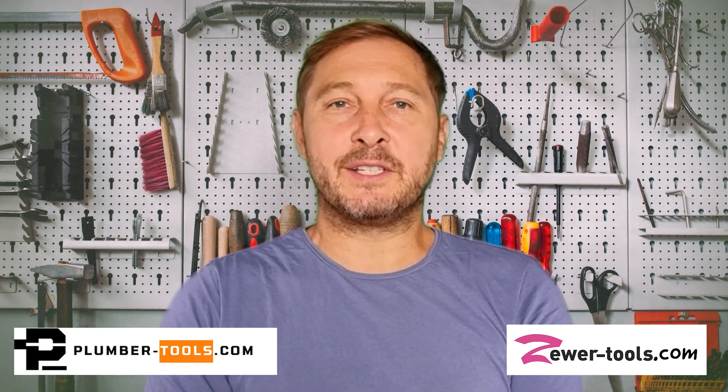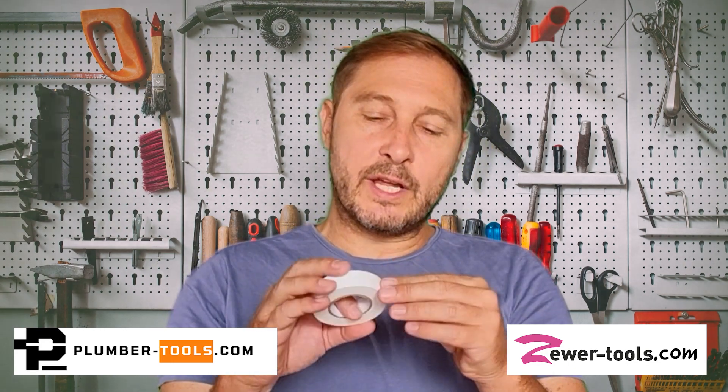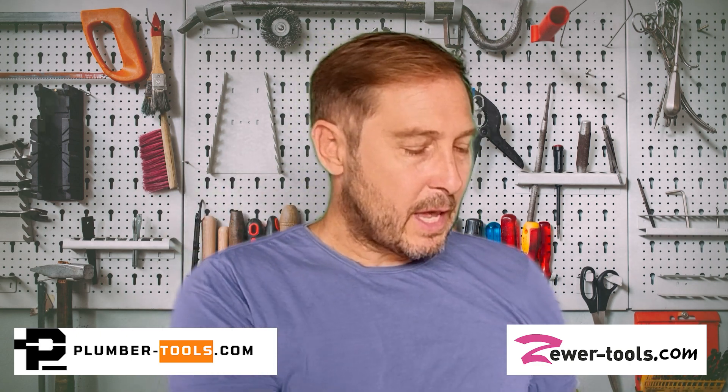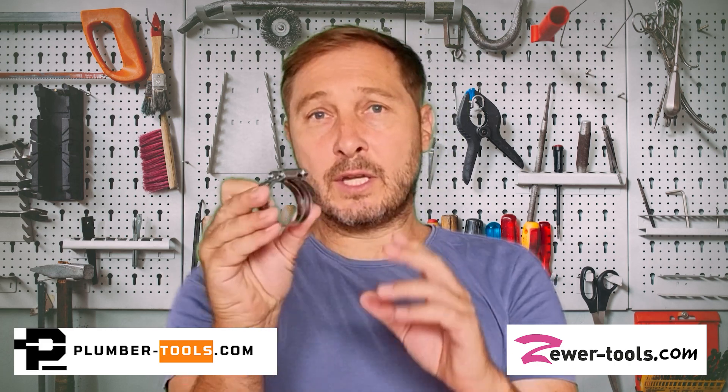Building a packer is relatively easy. You're going to need some Teflon tape — I'm sure everyone's familiar with this. You also need some electrical insulation tape — you want the stretchy variety, it's very common everywhere. And some fasteners. I've just got some cheap fasteners that I picked up at the hardware, but if you do an internet search I'm sure you'll find some really fancy ones. The most important thing to remember with your fasteners is that you want the profile here to be as small as possible, because this is a risk of getting caught on an angle or a bend or something along those lines. So that's the important thing to take into consideration when choosing a fastener.